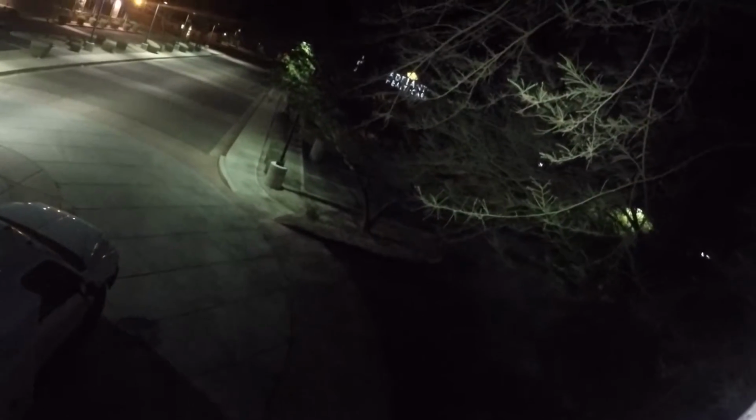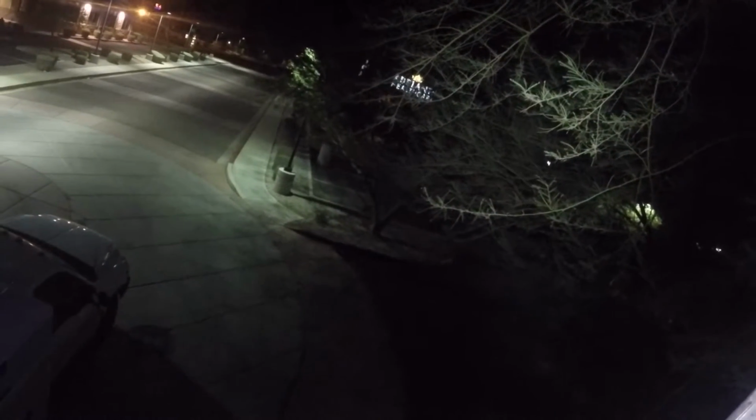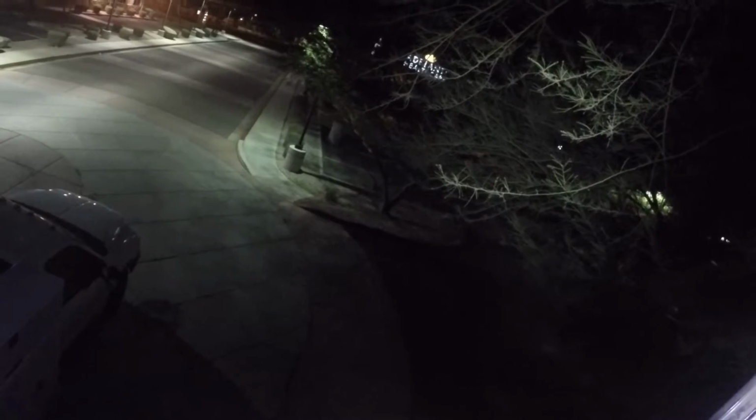And I also like to look at the bulb, make sure it's black. Sometimes if it's just burned on the ends like that, that could be a component inside the ballast causing it to prematurely fail. But this one looks like, you can see it ruptured on the side there.